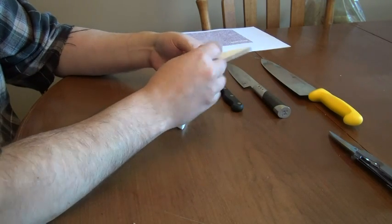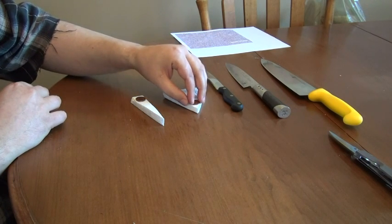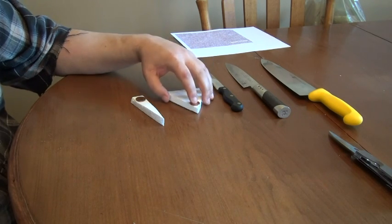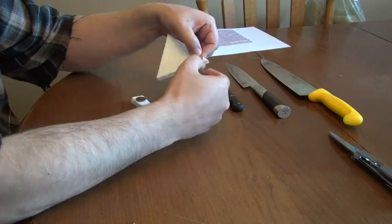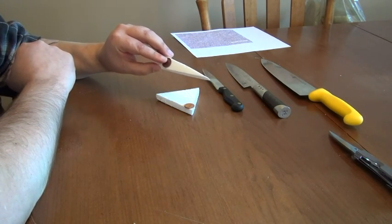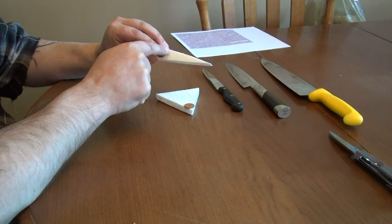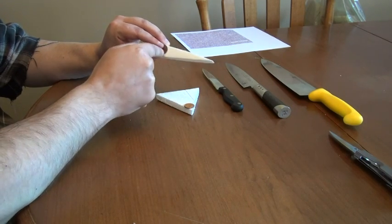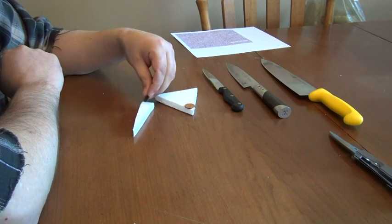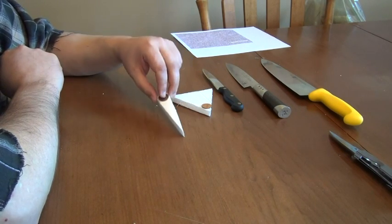Look what happens with the Nilakka edge — you can only get the carbide cluster to about right here. Comparing them side by side: on your basic everyday 20–25 degree knife you can get all the way out to the apex before a problem; on the Nilakka you can only get right out here. That's where issues begin — if the edge is going to break around the carbides, that's where it breaks off. So the Nilakka will start to break off way back here and everything beyond that cracks right off around the carbides. That's one of the reasons why high carbide steels generally benefit from greater edge angles — the greater angle stabilizes the large carbides in the steel. When putting a really fine angle on a knife, you want a finer or smaller carbide.